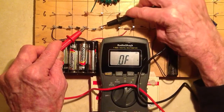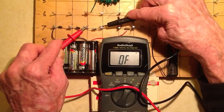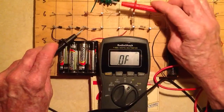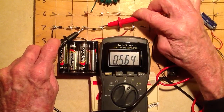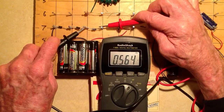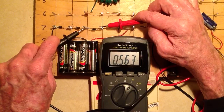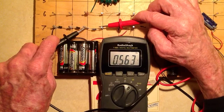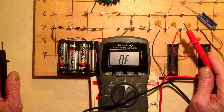Let's try this one — we shouldn't see anything here, because we're trying to force electrons through this diode from anode to cathode, and that should not occur. Unless, of course, you exceed the peak inverse voltage or the avalanche voltage. And we see that it works: electrons can flow from left to right, that is, from cathode to anode. For a diode, remember, electrons should always flow against the arrow, but not in the direction of the arrow, under normal operation.